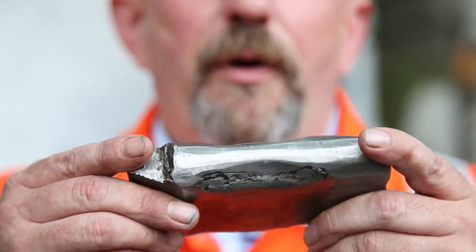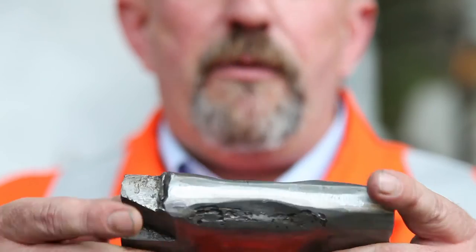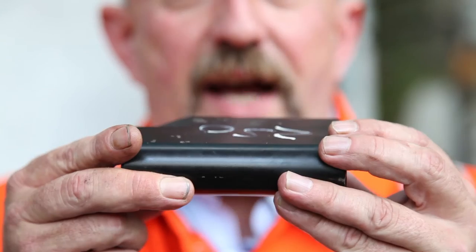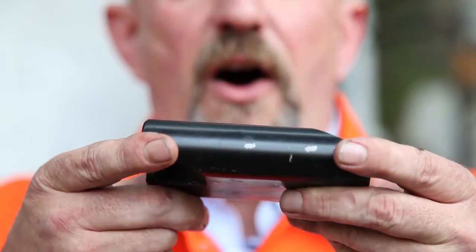You're not treating the hammer with love. You need to stop blank firing the breaker. This is the main problem with retainers that look like this. If you don't blank fire the hammer, your retainers will last a lot longer and keep in far better condition.